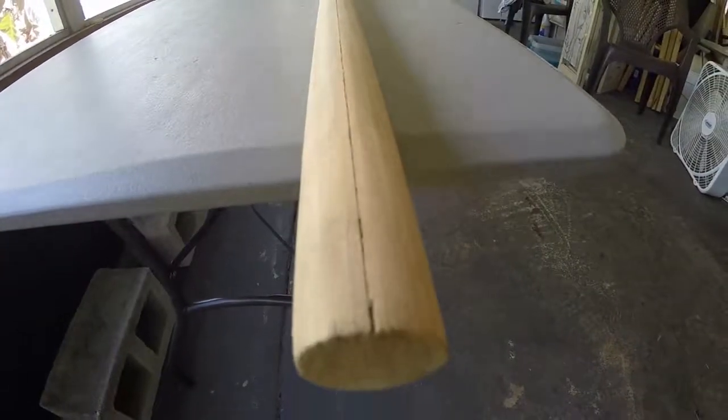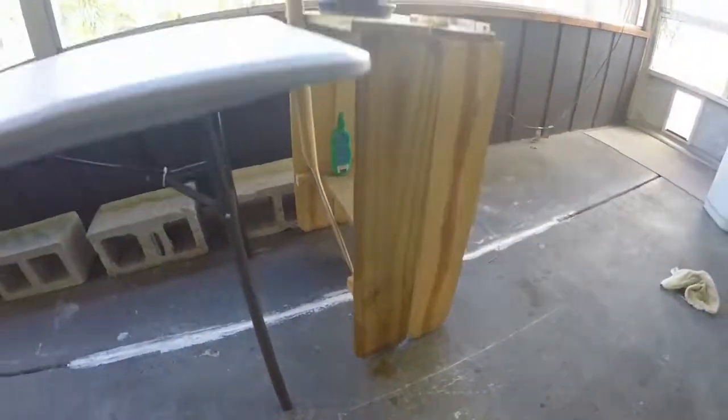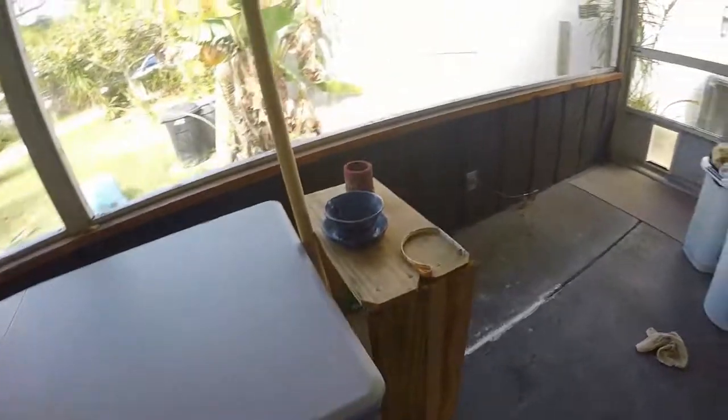I did find something problematic in my paddle. I got voids in the glue. But I'm gonna fix that real quick. I was using an old bottle of glue when I was gluing this thing up. But I'm gonna go and refill those and dress them off and get it ready for the paddle handle.